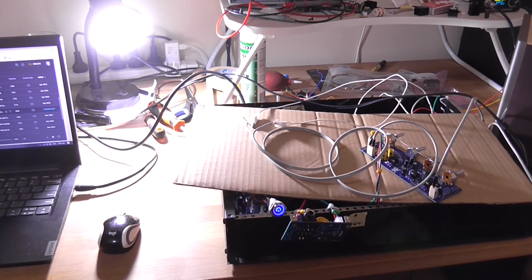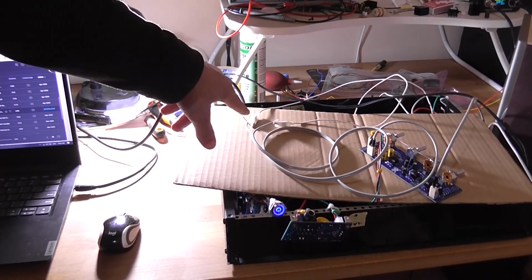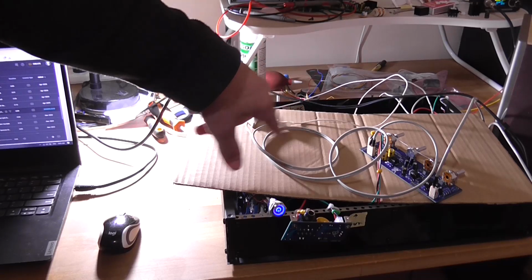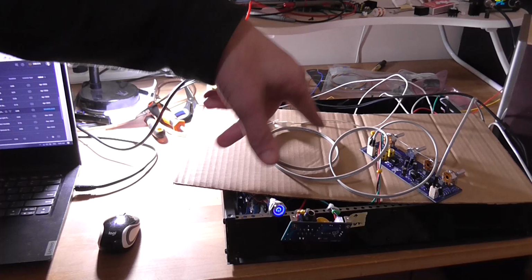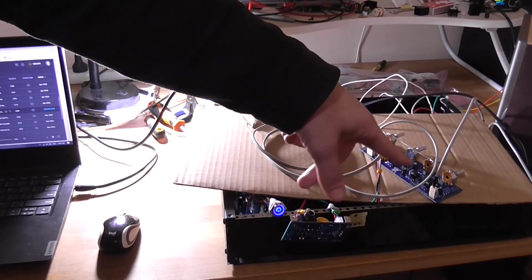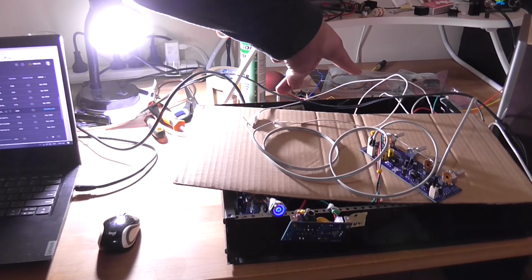Enough of that. It sounds all right, apart from that buzz, which kind of is reminiscent of a TV, but that's only because my output lead is sitting right above the toroidal transformer. So when I actually come to do the front panel, which will be the next task and next video, I'm still waiting on the selector switchboard, I'll route the cables correctly and terminate them correctly and then test it again.